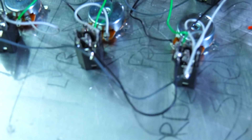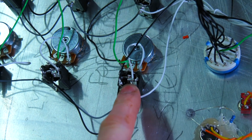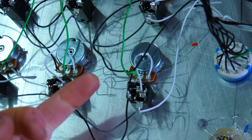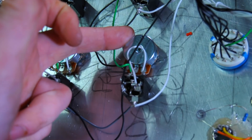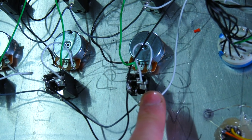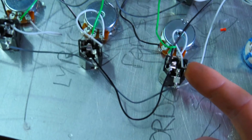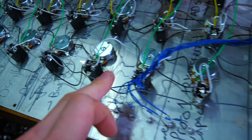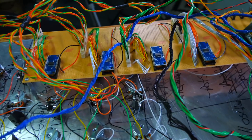How is the CV working? This wire carries five volts into the jack switch, and when there's no jack plugged in it sends five volts to the potentiometer. When you plug a jack in, the CV replaces the five volts and goes into the potentiometer, meaning the potentiometer becomes an attenuator for the CV instead of for the five volts. There's no voltage protection - you just have to be careful what you plug in, because adding voltage protection for 48 potentiometers would be an absolute pain. You literally solder five volts to the jack switch and then wire across to the pot.